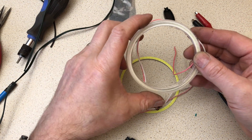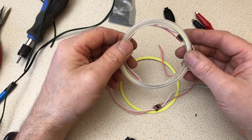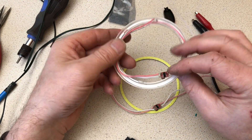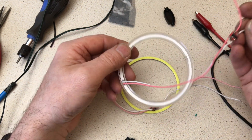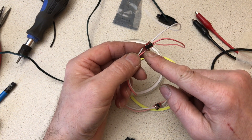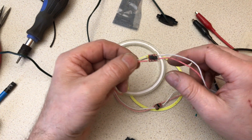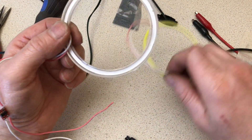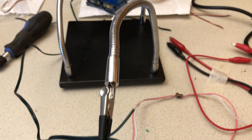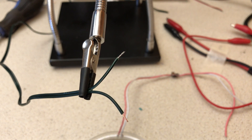The reason I want 24 volts is the pillar drill has its own built-in power supply that I'm using for an air compressor line — an actuator to turn air on and off to blow debris away while I'm drilling. All I'm going to do today is put a little longer cable on here, which I'll solder on in a second, move the regulator circuit away from debris, and put it inside the box where the 24 volt power supply is. There's a helping hand — a third hand — that I made in a video a few weeks ago and it's in use now. Let's tin those cables up before we fit them.